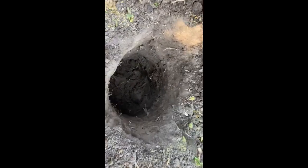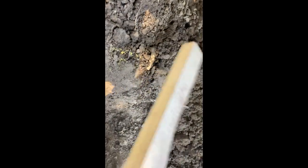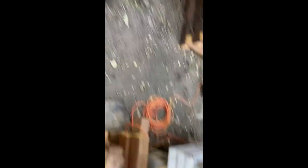One is done. I want to show you what my process is in case this is helpful for you. Here are some holes. You want to get that hole wall as straight down as possible. Cut out any tree roots, and then I have this jig right here that I made 24 inches deep, so I just stick this in the hole, and when it hits the bottom and touches the ground in the center, I know the hole is deep enough. Also check your fit with your tube to make sure your hole is round enough and straight enough down.